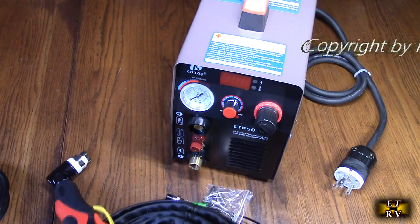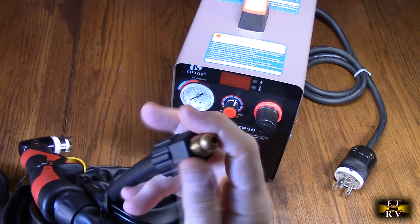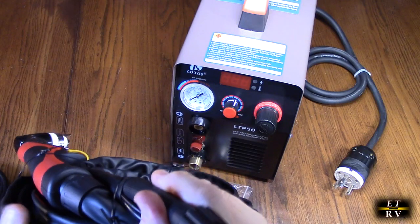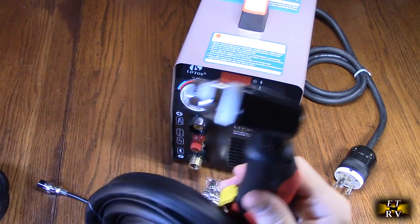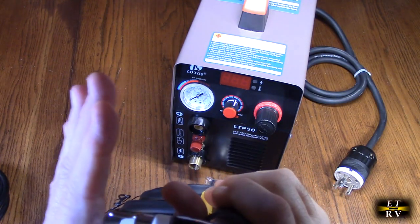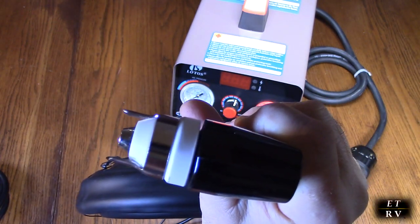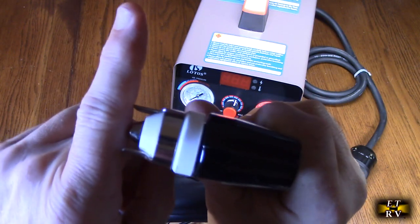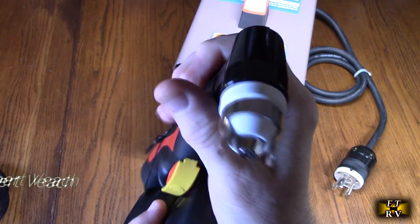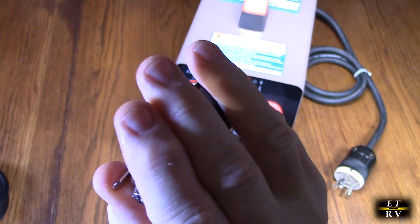This connection right here is very important. It has a quick rotation piece so you can easily rotate it. What this does is your air goes in there — filtered air from the system — and it appears on the end of the torch itself. This is non-contact, which means that as you go near the metal it's going to start forming the arc, so you don't have to actually hit it like with a torch lead. This will automatically go, and then the air is sent in and channeled in such a way combined with that arc force to create the cut.